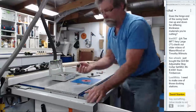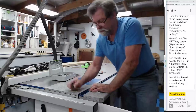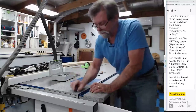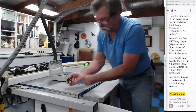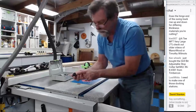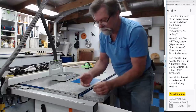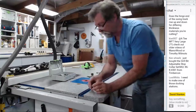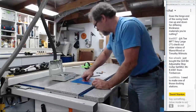And also, whenever you put another cutter in, see I'm coming through, do that and gets rid of, can you see it all there? This is all crap that was stuck in between the expanding parts of the collet. If you don't get rid of it, it can't close up and hold onto the cutter properly. That's a huge risk for you if you don't do that.